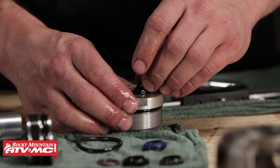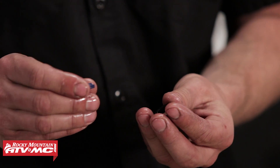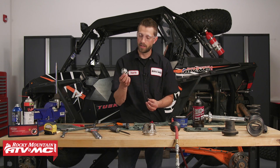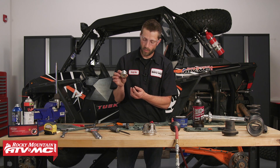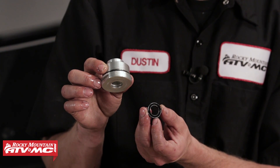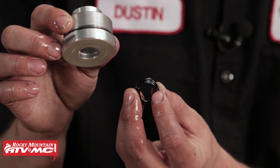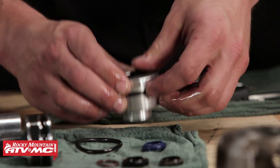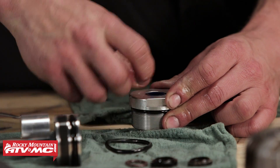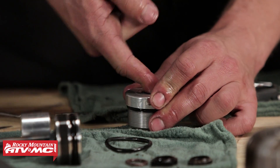Once you've got the o-ring installed, move forward with the oil seal. There is a difference between the oil seal and the wiper — the wiper is much stiffer while the oil seal is softer. To orient the seal: this is the bottom side of the seal head, and we want the lip of the seal facing downwards towards the ground. The back side of the seal has a recessed end, and the front side facing the ground has a lip that protrudes from its body. Get the oil seal installed and lastly install the wiper — it may be a little difficult so just work at it. Once the seals are inside, run your finger along the inside diameter to make sure there's no bulging and they've seated properly.